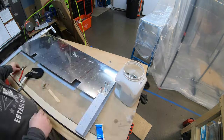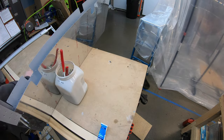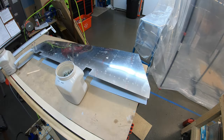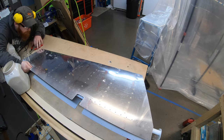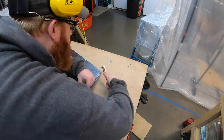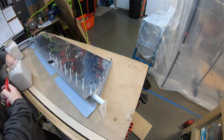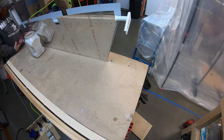I would recommend, before putting that 713 on, going ahead and doing the edge rolling on your leading edge that you'll have to roll later on. It'll make that process a whole lot easier. When I went to roll those leading edges, it caused a lot of headache trying to get that edge rolled. I'll show that in the left elevator video coming up to further explain that if you're not quite sure what I mean.